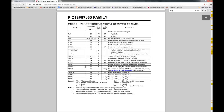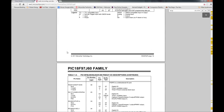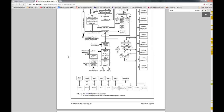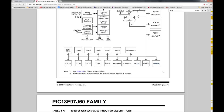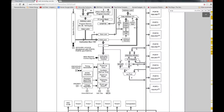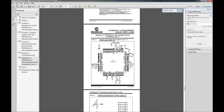It's a good family with a lot of cool stuff, but the main things are the Ethernet port — embedded directly in the chip — and the Master Synchronous Serial Port, or MSSP. These two are the big pieces that make the whole thing work: the Ethernet provides the TCP/IP hardware on board ready to go, and the MSSP handles SPI communication with the external ENC28J60 if you want to use that route. That's basically the PICDEM.NET 2 kit and how it's laid out.